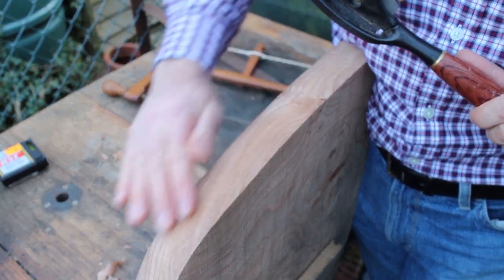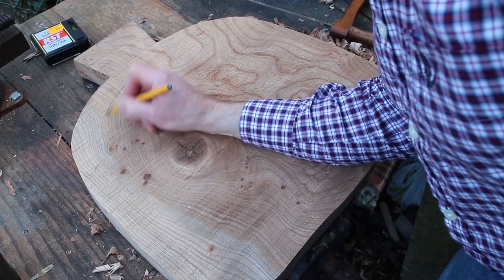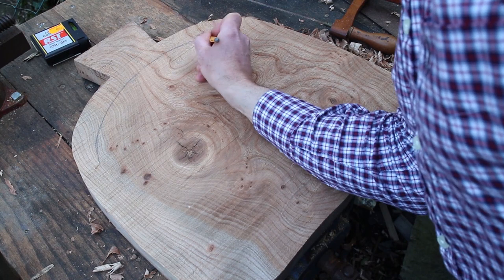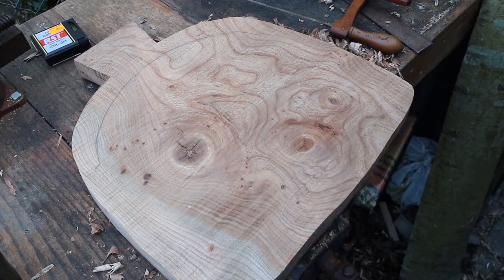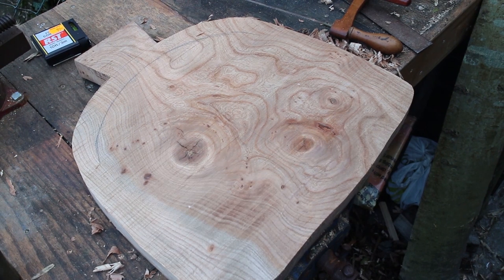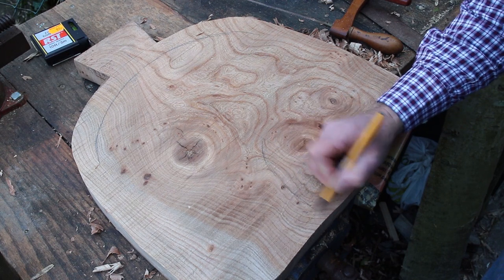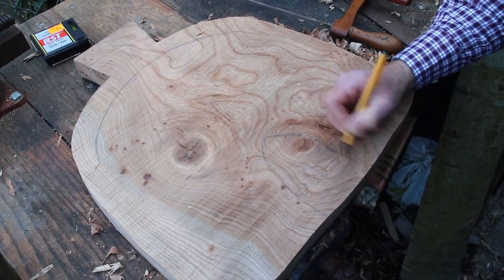The grain on the elm goes all over the place — that's partly what makes it so strong. It's lovely wood, smells really nice as you work with it. I'm marking a boundary just for where the spindles are going to go, at each side. It doesn't have to be precise but it's essentially a no-go zone for the hollowing out. There'll be a couple of back spindles coming up the back here, and the other area I want to semi-protect is what I call the pommel — the raised bit for the seat.